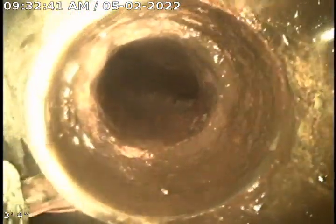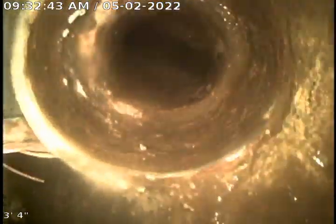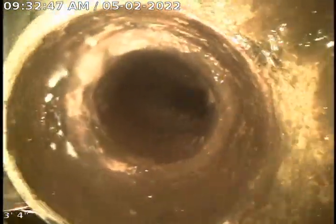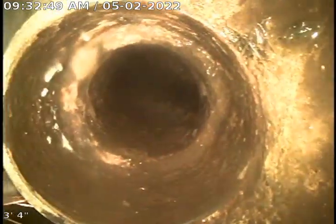Here is the basement cleanout which we were working from. You can see a little bit of a reduction there — it's probably a 3.5-inch cleanout. That reduction right at the Y stopped me from getting a 3-inch blade into this pipe, so we are limited to just what the 2-inch can do, which as you can see is only removing about half of the clog. It's a 4-inch pipe, so for proper access we would need a 4-inch cleanout.